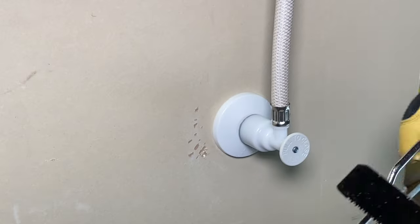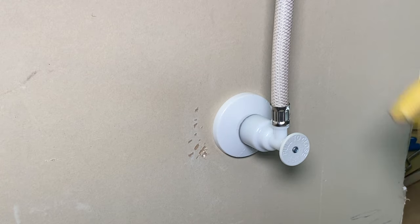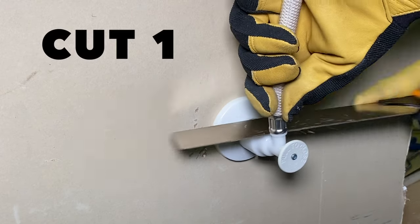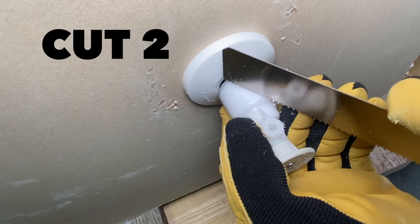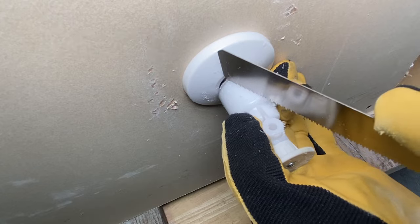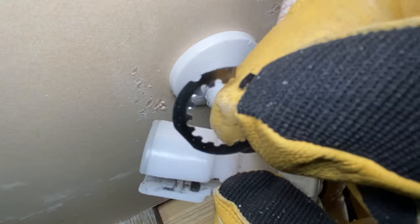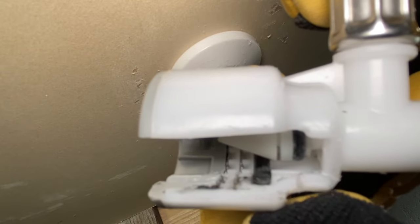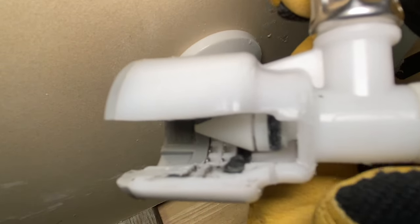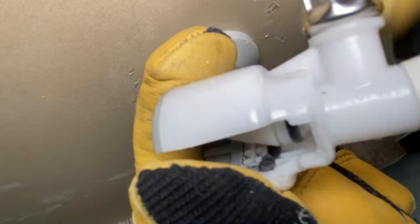The thicker blade means I'll be able to stick my screwdriver in the holes and pry it apart. What we're going to do is make four cuts. First thing we're going to do is get this out of our way. I like to take this and just start cutting it at a 45-degree angle. You're going to cut until you start to feel these little clips — and you can see by this cutout that we've got those in a couple of places. Then we're going to make another 45-degree cut on the other side and chop this whole little area off.